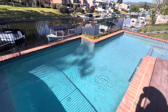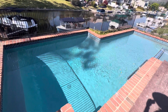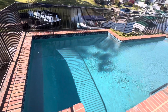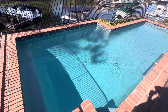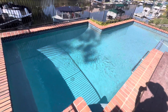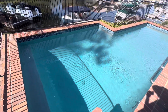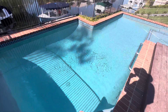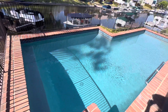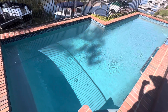I'll keep you guys updated, but all it is is coming twice a day, balancing chemicals, brushing, and keeping an eye on the filter pressure to make sure it doesn't get clogged up with all the plaster dust. As you can see, things are looking good. Thanks for watching — if you have any questions about the startup process, feel free to ask in the comment section below and I will answer as soon as I can.